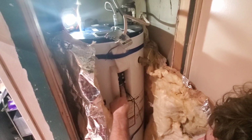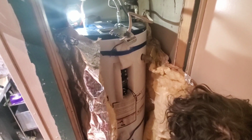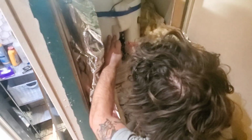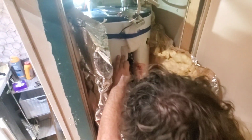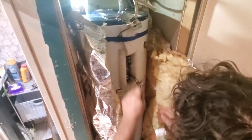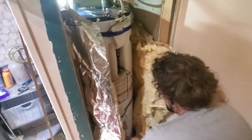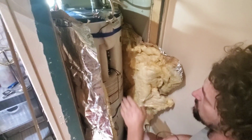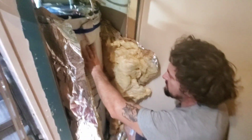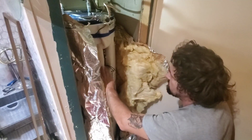Now, before we were able to adjust our temperatures manually, even with no power, and get it to kick over to where it was supplying our bottom element. If that was the case, then when we touch this post, which goes to our bottom element, it would turn to almost 0, okay? So we have tested our thermostats. We have tested our new elements, and everything's good. So what we're going to do is hook all our power back up, and I encourage you, take pictures and hook it back up identical. Now, on the elements, it doesn't really matter.